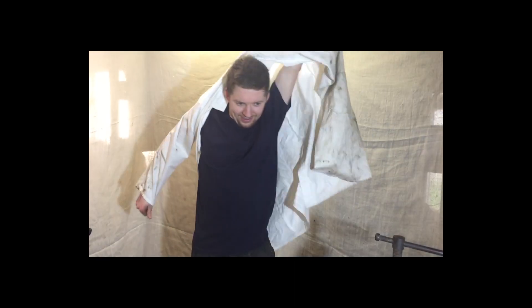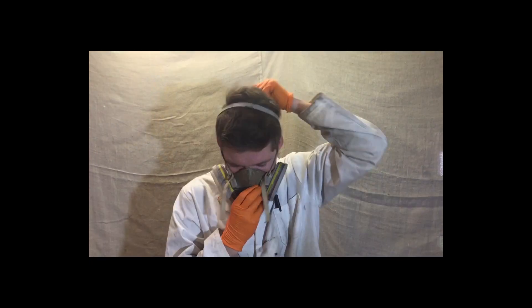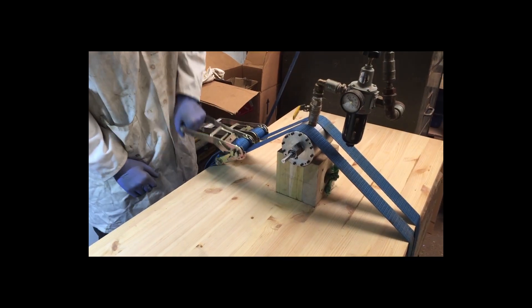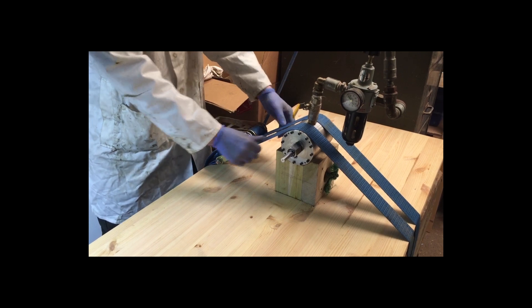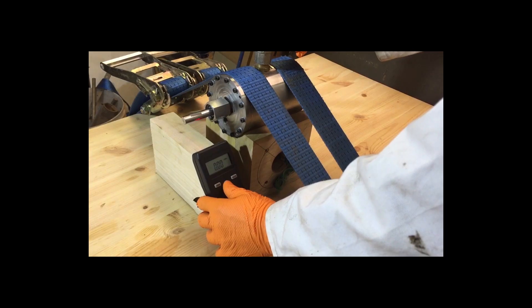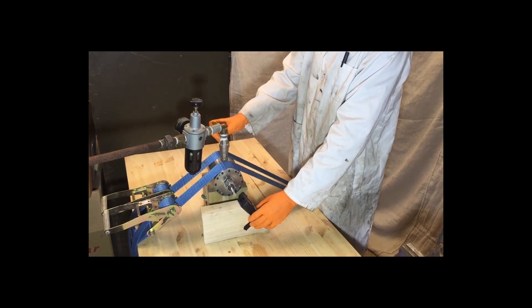As the COVID-19 pandemic forced the closure of University of Limerick campus, testing could not be carried out on college grounds. Luckily, one of the group members had enough safety gear to carry out testing in an environment free from COVID-19 risks and other possible dangers. Using a compressor, air was fed to the turbine inlet at 4 bar pressure, and a maximum RPM of 14,000 was achieved.